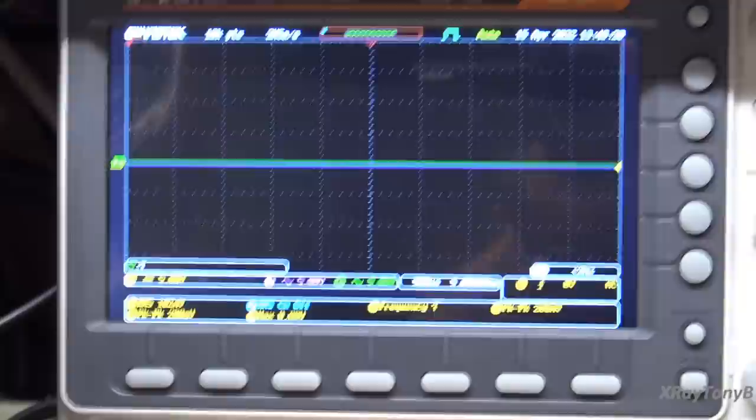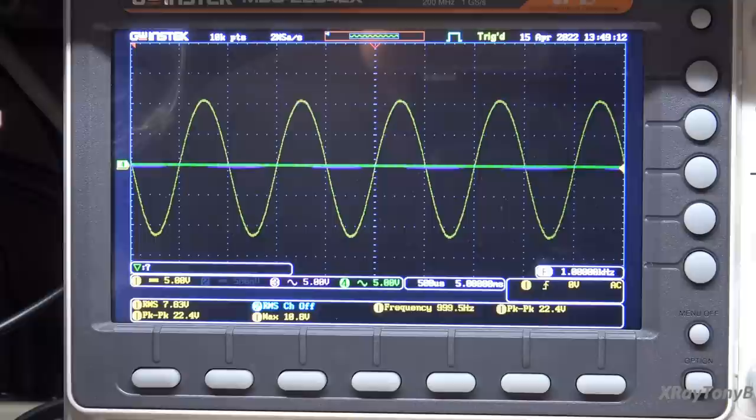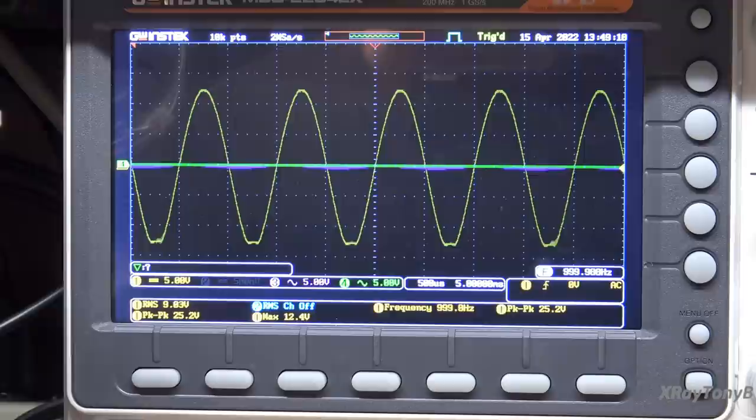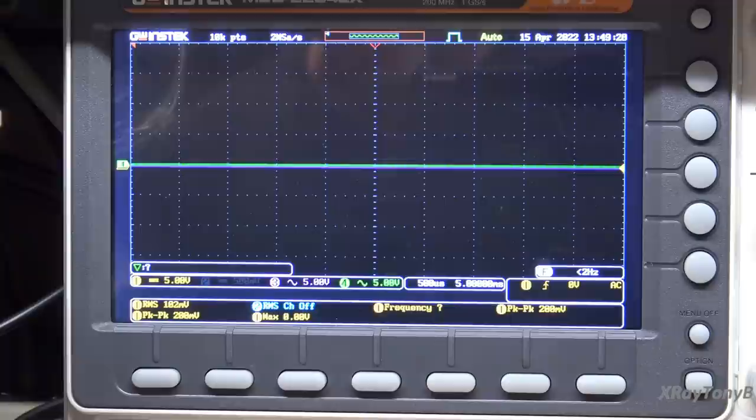Alright, let's put some signal in it. Amplifier's on, signal generator connected to left channel. Look at that — right about the same place it starts to break up, right around 9 volts. You get that tiny little bit of oscillation on one side. That's probably a design trade-off, or it could be that the particular value of capacitor wasn't quite right — I think that 100 picofarad probably should be closer to 150 or 120 picofarad, and that would probably get rid of all of that.